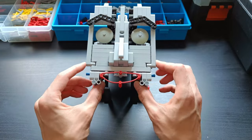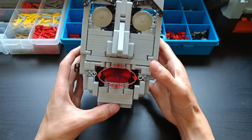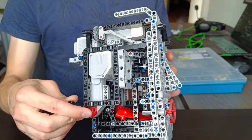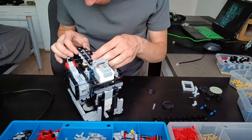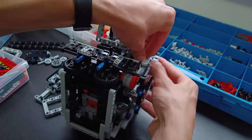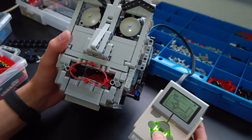After this, I spent literal weeks designing the mechanisms for the mouth. I used the final two motors in its head to both move the jaw and corners of its mouth. The jaw moves pretty easily with just this large motor, but the corners of the mouth are connected using more complex linkages than anything else found in this entire head. This is exactly why it took me so long to design this mouth mechanism — it seemed like literally nothing would be able to connect these axles, but after almost two weeks it was finally capable of moving its mouth like intended.